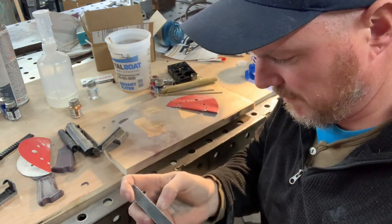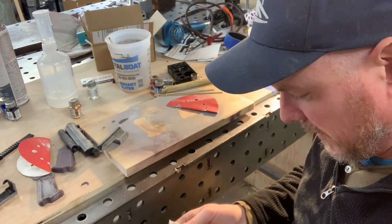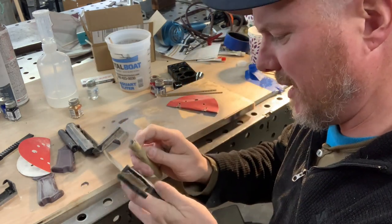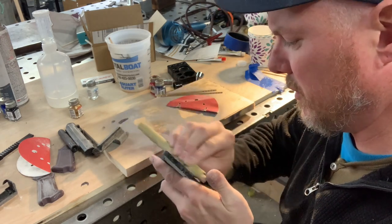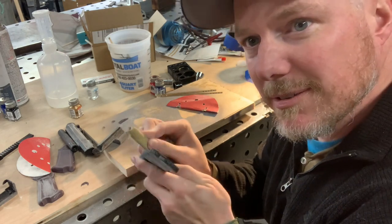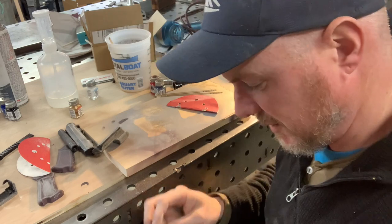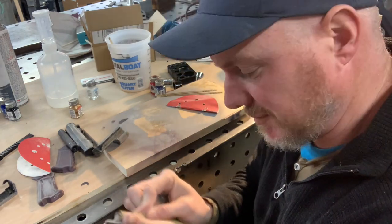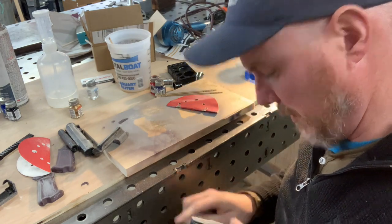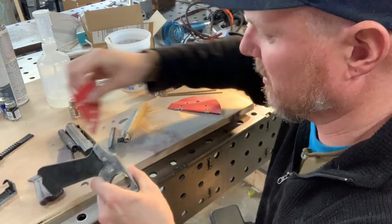When I get to about there again I'm going to stop, because I want to be able to sand this much finer. In this weird little area here, what I do is take a piece of sandpaper and roll it up, and then I can get into these little areas around the little nubbies. And trust me — if you ever meet me, the one thing I constantly hate to do is sand. I abhor sanding. Trying not to sand down those little nubbies too much. That was just a few seconds and we're already in the ballpark, so to speak. I'm actually going to go back up to the 60-grit to take it down a little quicker.